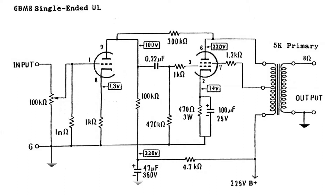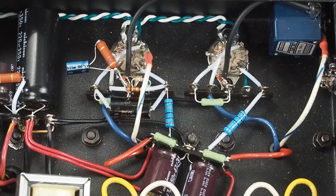Unfortunately, when I got this thing partially wired up and didn't have any cathode voltage and was scratching my head, I realized that I had the pin numbers wrong. Hopefully you all are waiting for me to finish this before you start building one of these, so you won't make the same mistake. I fixed that problem. The wiring was real ugly from having to move pins all around, so after I listened to it, I tore all that wiring out and rewired it in a more logical way.